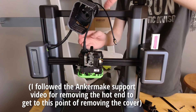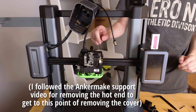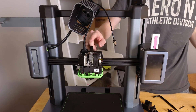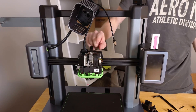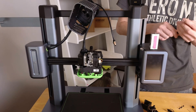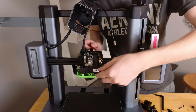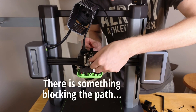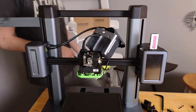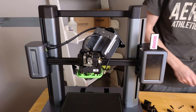So far I've gotten the silver cover off just by removing four screws in the back and popping it off upwards. Now I'm going to undo the spring on the lever here — that just comes out pretty clean on its own. It's just a spring attached to the screw, which is cool — that way you don't lose the screw. And then this just flips forward. Yeah — there is a piece of filament in the way. I don't know how I'm going to get that out because it is not heated right now.